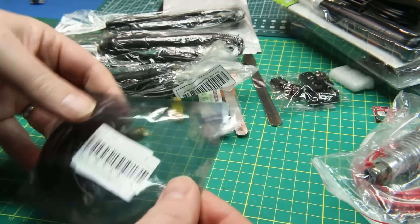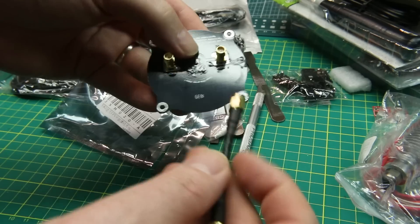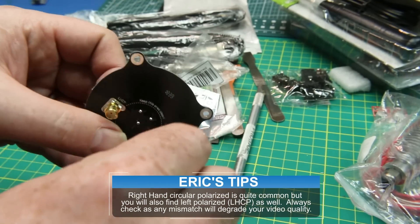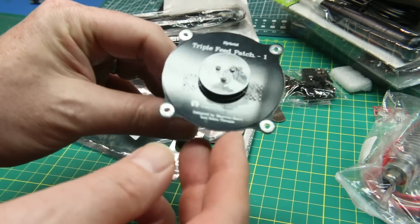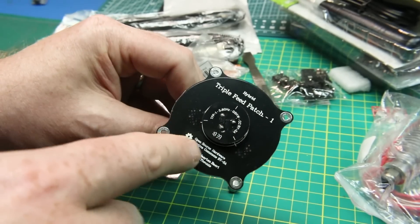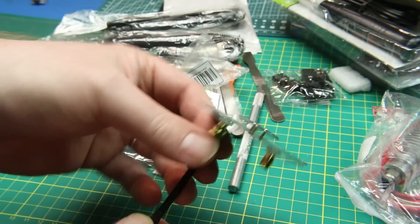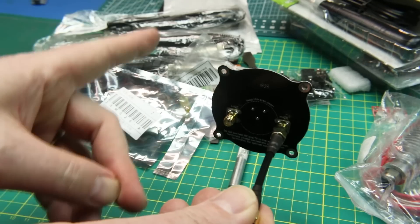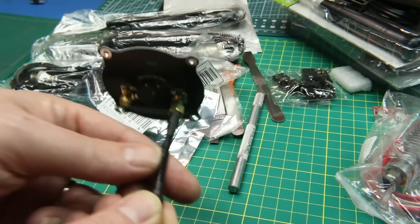One last one before we go outside. I've been waiting for this for a long time — this is a patch antenna for my 5.8GHz FPV equipment. I'm going to give this a try on my diversity receiver. It has connections for right and left hand circular polarization, and we're running right-hand on all our stuff. It'll plug right into my FPV goggles. This triple-feed patch will work great for direct line of sight — gets signal directly, but if skewed 90 degrees it'll have very low signal and high noise. Straight on, it'll work well facing the quad. My Omni will be on the other side, and the diversity will switch between them — whichever signal is stronger.